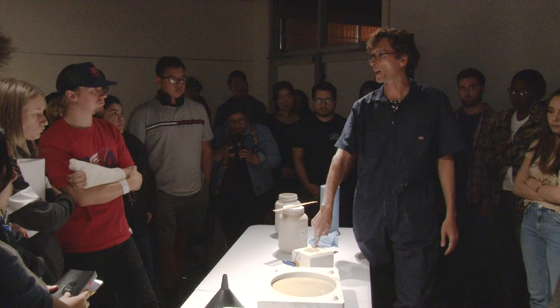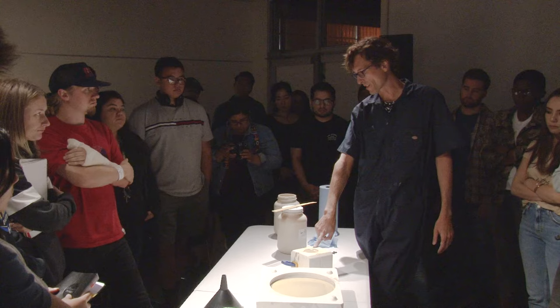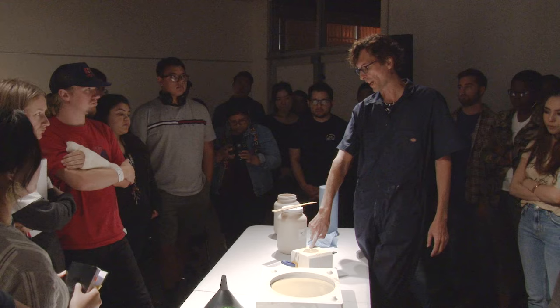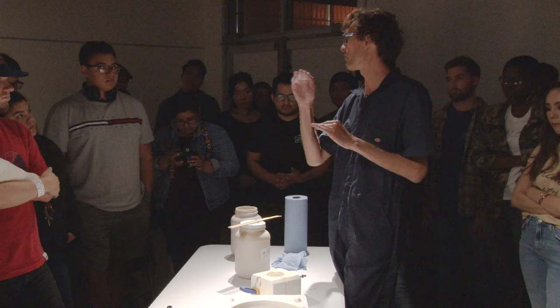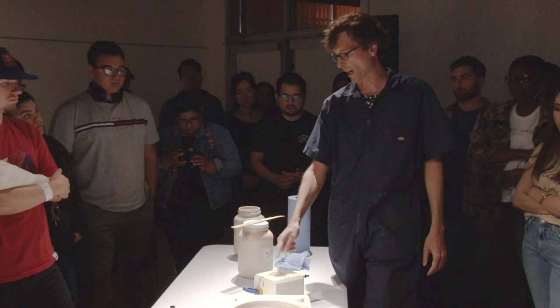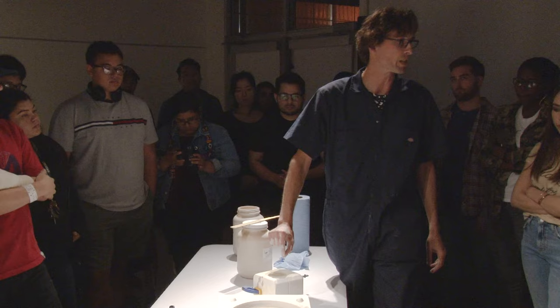What this also means is that at this moment, I don't really have an accurate understanding of how thick my cast is, because we can guess that below the water level of the clay our thickness is still increasing, whereas above the water level of the clay it stays the same, right? Normally, if I kept on topping this off, I could move a little bit of the liquid out of the way, and I could always tell exactly how thick my cast is going to be. At the moment, we're going to guess that it's a little bit thicker than this without knowing exactly how much thicker.